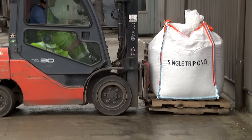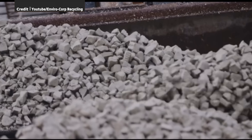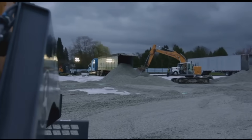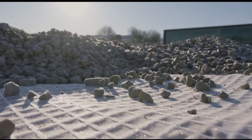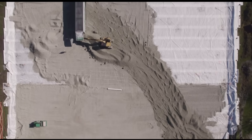So what is it used for? Those bubbles in the EnviroRock are the key. The goal is to replace styrofoam, which is often used in certain construction projects, and they say they're getting buy-in already. We've used it on a soccer field in the greater Vancouver region, sitting over top of an old bog or swamp-like material. We're using it underneath the road on Fraser Highway in Langley in preparation for the SkyTrain. We've also used it under concrete slabs for foundations, where it can act as radon mitigation and styrofoam all in one.